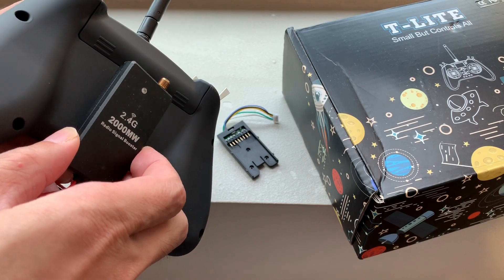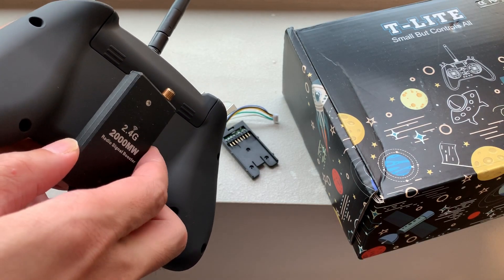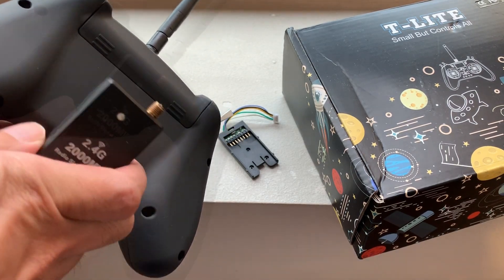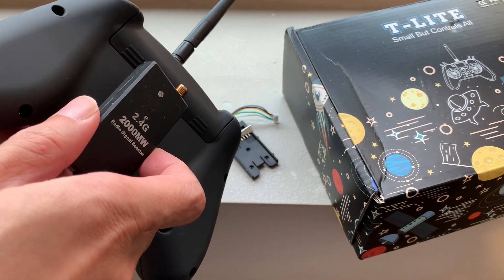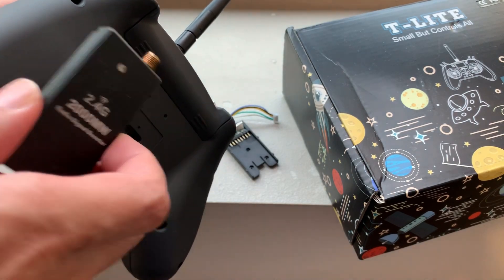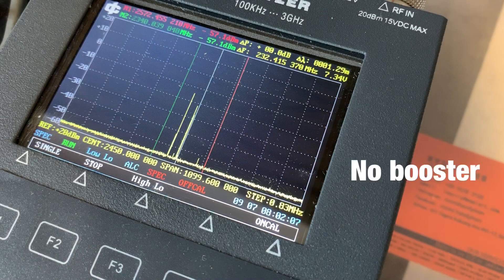The challenge here is the power this amplifier needs, which runs on 5 to 15 volts, but we only have a one-cell lithium-ion here which is 4.1 volts. So with that we could output high-power DSM2 and have long-range control for all of our DSM2 or DSMX aircraft. To verify if there is really any increase in output power, I'm pulling out my spectrum analyzer to do some readings.